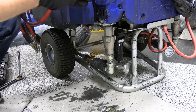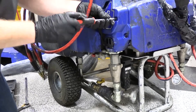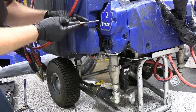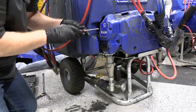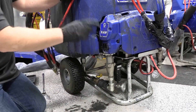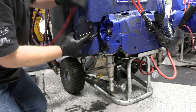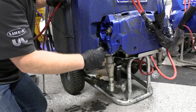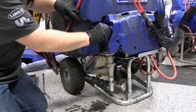You've got your end cover off your motor. Now this particular machine has the cycle switch or the cycle sensor, so this cover has been added later. You can tell it has the sensor in it, so you just want to kind of keep it out of the way. And then you've also got the magnet that's on the end of the crank — be very careful not to lose that magnet.